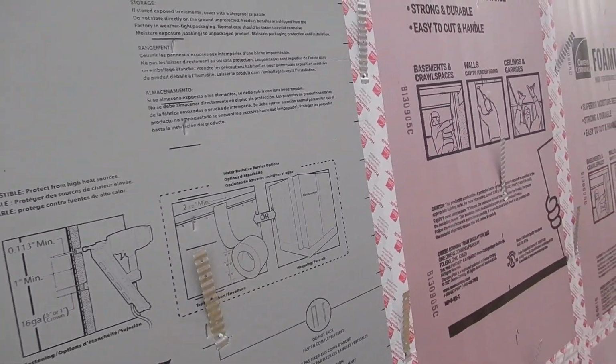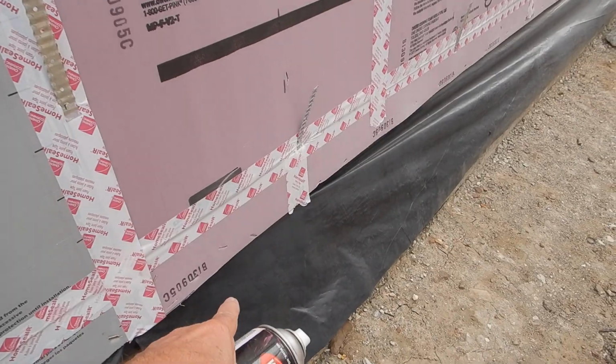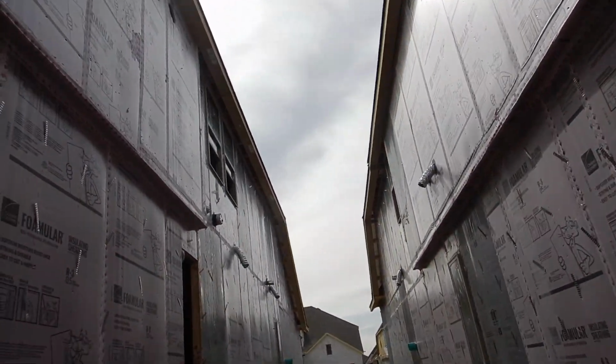And architecture is regional. So when water comes through the wall, it drains down the drainage plane, and all the flashing drains out. This hole will not allow that.